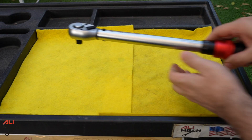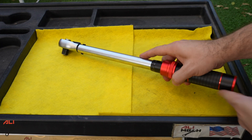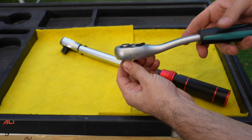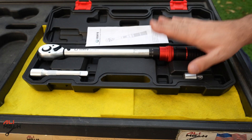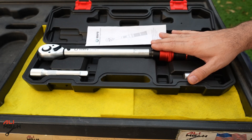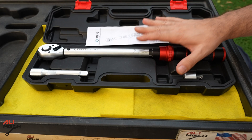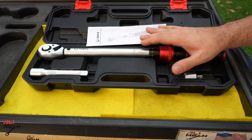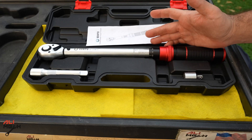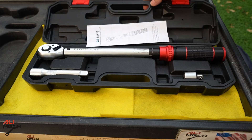Another thing you should know: do not use the torque wrench as a ratchet, because it has a limited lifetime. Save it only for torquing — use a normal ratchet for tightening up first, then torque it with this one. That is most of the things you should know before buying a torque wrench, how to use it, and why we use it. The torque wrench I used will be in the video description below. Hope you guys found the video useful and learned something new — if so, like and subscribe if you haven't already, and I'll see you in the next one, bye for now.